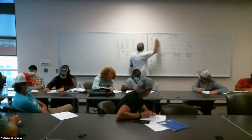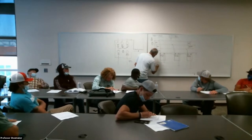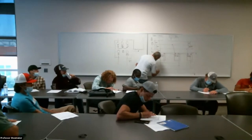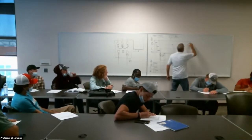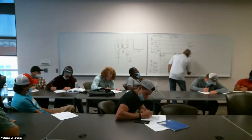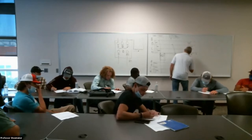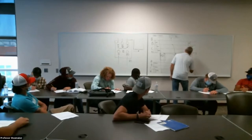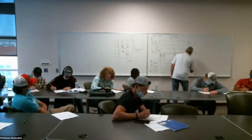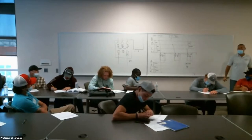What's the voltage here? 277. B? 277. C? 277. How did I do it up here? A, B, B, C, A, C. What's my voltage? 480. Good job. 480. Work, I'm done.